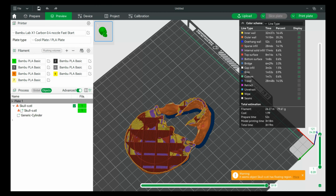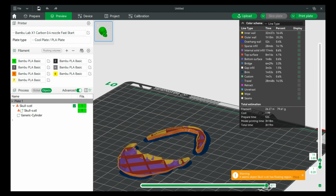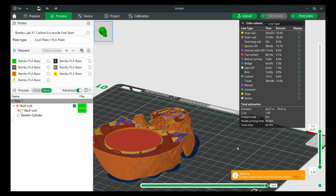This part looks close, but we might be all right. If we go up some more, I just want to make sure that we don't have any holes in this container that we're creating. So the back end's fine. The one thing I did notice, there was a lot of extra space at the bottom. So before even the cavity starts getting printed, we're up a bunch of layers. So let's see if we can change the Z height just a smidge.